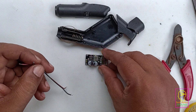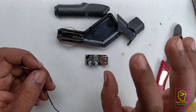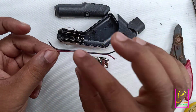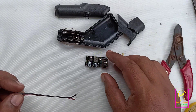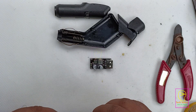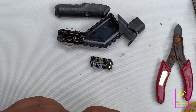We can use this wire for connecting the adapter terminals to the charging module. We don't need a very thick wire because when charging at 5 volts the maximum it will deliver is 3 ampere, and when fast charging is enabled the maximum voltage is 9 volts or 12 volts with a maximum current of 1.5 ampere or 1.75 ampere. So this wire will be enough.